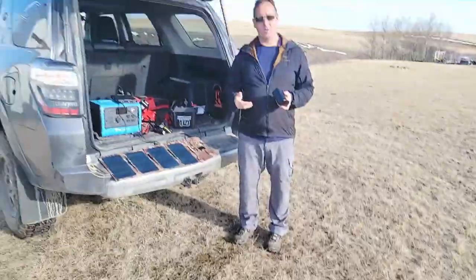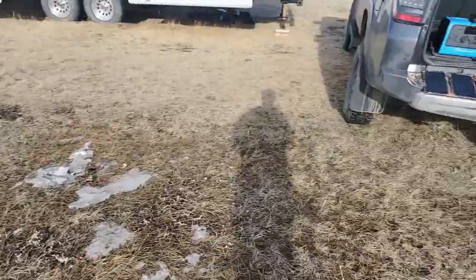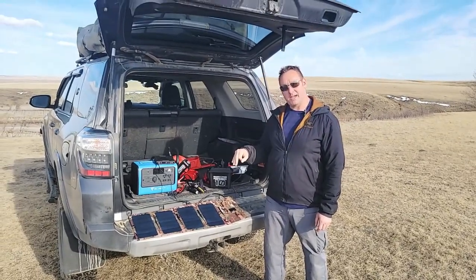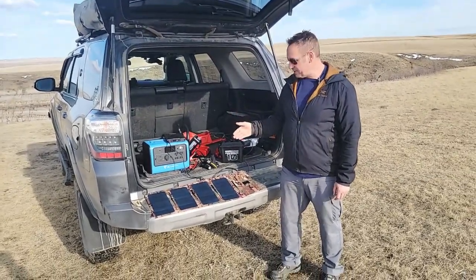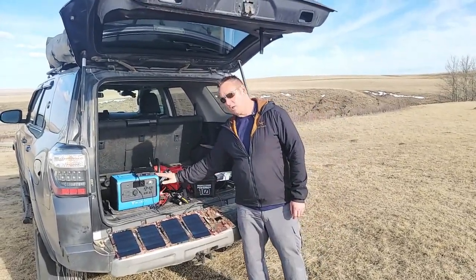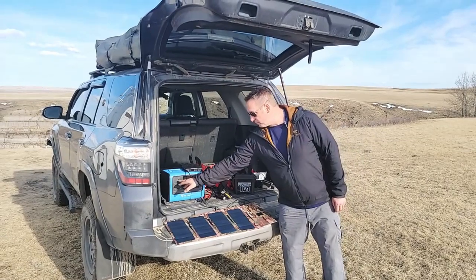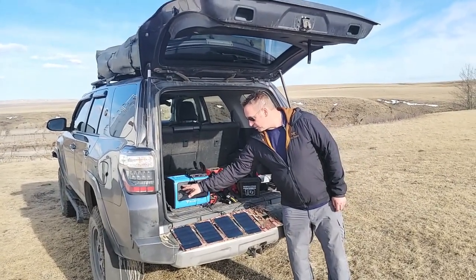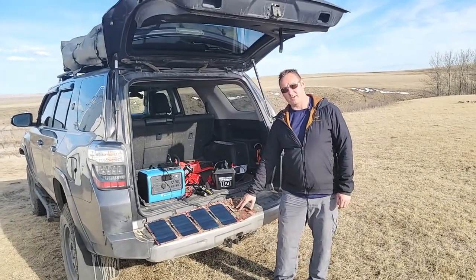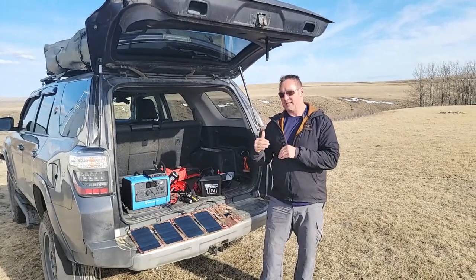I plan on creating some more videos down the road. I just wanted to give a quick intro into the DC5521 port. I haven't spent a lot of time talking about it because more people are interested in USB and USB Type-C. But I've had a ton of people asking — can we trickle charge smaller solar generators that have a port like this? Yes, we can. Just make sure you double check the voltage, amperage, and wattage. This one, for example, is 12 to 28 volts, 200 watts max, and our DC5521 port is rated for 12 volts, so you can easily do that.